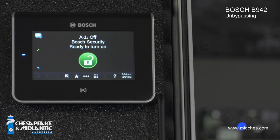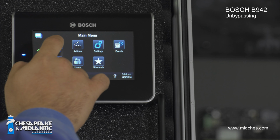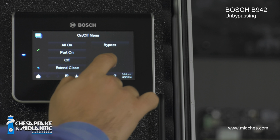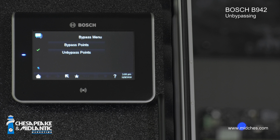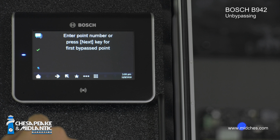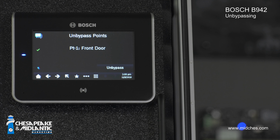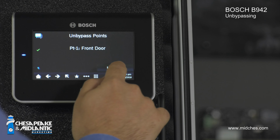To unbypass a point, we simply reverse this procedure. So hit the three dots to get into the menu, go to on-off option, go to the bypass screen, select unbypass points. It'll tell me that I can enter the point number of the point that I want to unbypass, or I can scroll to it. And now it shows me that the front door is bypassed, so I'm going to unbypass it by pressing unbypass.